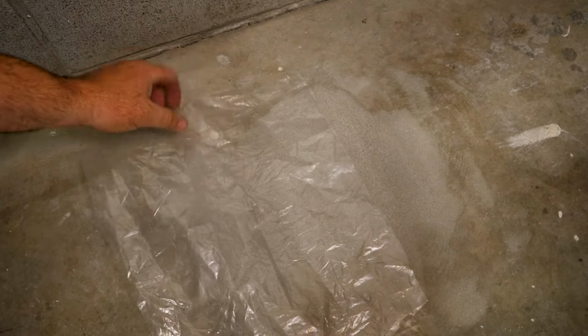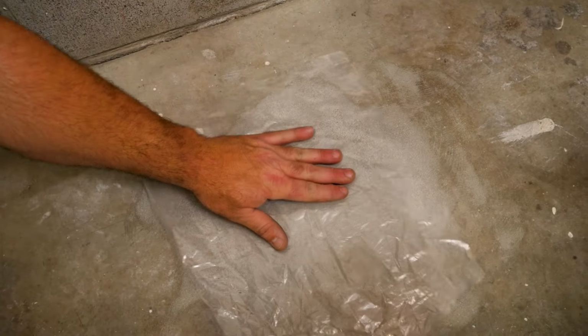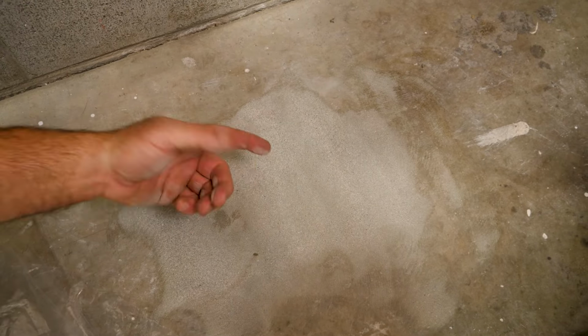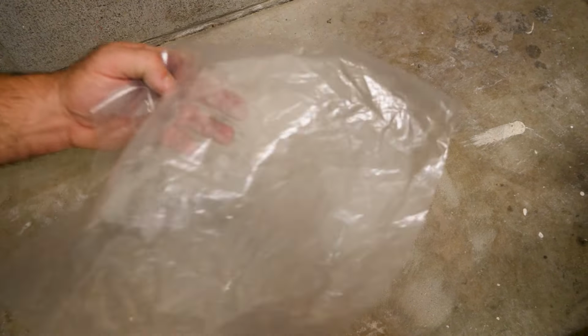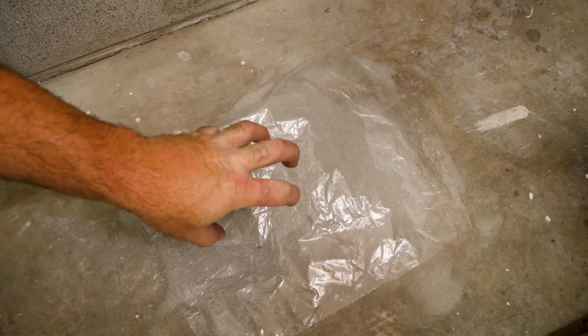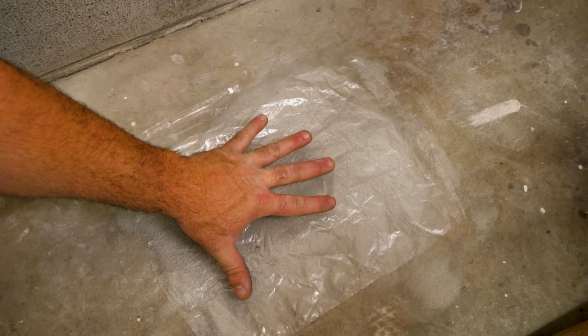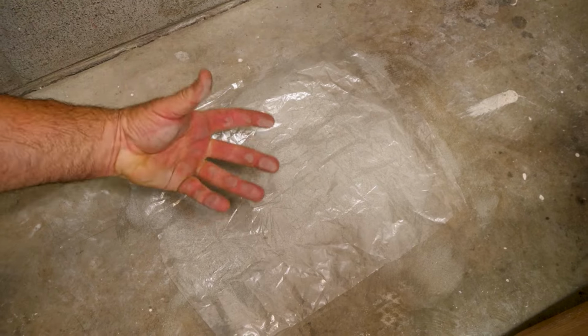All right, guys, so after you open up the concrete, we're gonna come and tape this down. And then tomorrow, when we begin our work, I'll peel this up. If I have any moisture, this is darkened, or if there's any moisture on my plastic, I now know I need to go to that next test, which I'll leave a link in the description on that test. It's a dome, you glue it down, you got a powder, you first weigh it, put it under there, keep it 24 hours, peel that dome up, reweigh the powder, and that tells you exactly how much moisture is coming through.